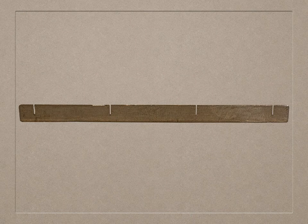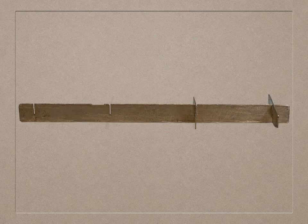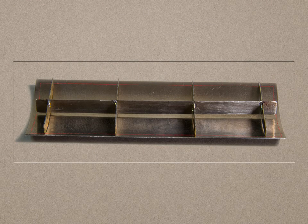Separate the formers and clean them up — you can see the hole I drilled more clearly in this image. For the framework, you need a longitudinal part equal to the internal length of your vehicle; ideally it'll be about the same depth as the formers. Rounding the corners helps when it comes to fitting the roof. Mark where the formers are going, taking into consideration any obstacles in your vehicle like curved corners, partitions or stretchers between the sides. Make the vertical saw cuts about half the depth of the piece, then slot the formers in one by one making sure they're all the same way round. Then solder them together upside down so that the framework is flush along the ridge at the top. Turn it over and you have your completed framework, which you can lay on the inside of your roof, centering it using the guidelines you made earlier. The frame may not match the guidelines exactly but this doesn't matter — just make sure any difference is equal on each side.